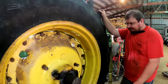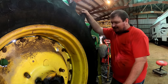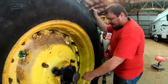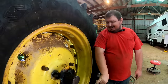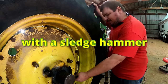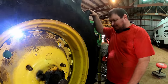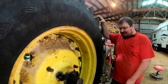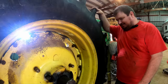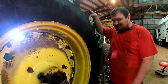And then, some people don't do it. I've done it because I think it helps. But put some heat in here on these wedges and crank down on the jack bolt and then eat your Wheaties this morning and pop the hell out of the end of this axle. Pop the axle, screw down on your jack bolts, but don't get overly crazy with them jack bolts because you don't want to bust your wedge. But heat, tighten, beat, repeat, heat, tighten, beat, and repeat. That's what we've been doing. And our hard work is finally paying off here, I guess, because we're fixing to roll this sucker off, maybe.